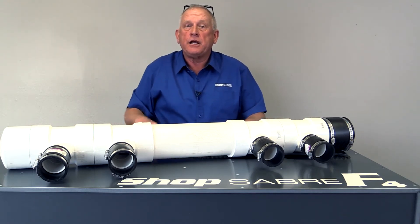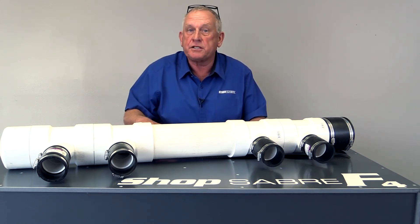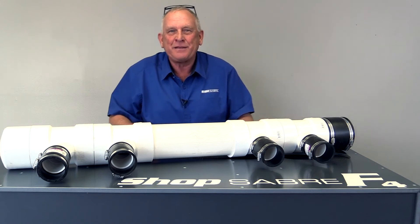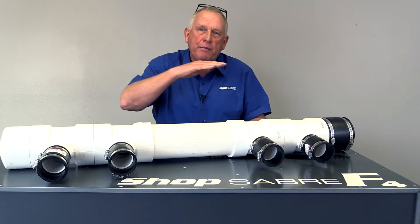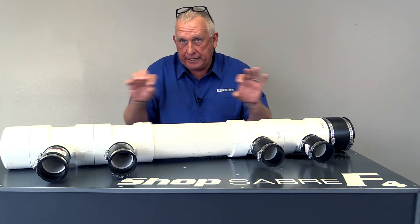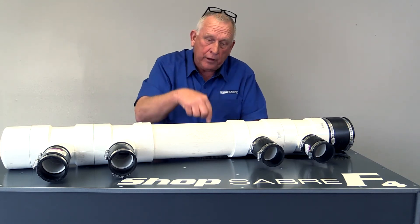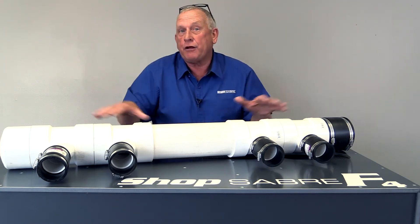On ShopSaber CNCs, you don't have to have a gasket between your spoil board and the top of the table because they're a precision machine. Let's talk a little bit about spoil board preparation because that seems to be an area people really don't understand. First off, we start with a piece of standard three-quarter-inch thick MDF, and we've machined the surface on top and bottom. That leaves the porous material that's on the inner part of it. That goes on the machine table, our material goes on top. When we cut parts out of the sheet, we only cut slightly into that so that we don't create a lot of vacuum leakage, and that's how flow-through works.